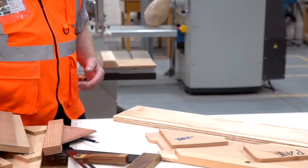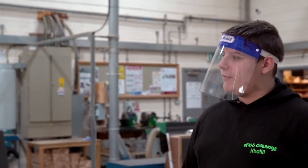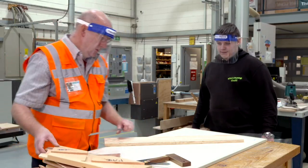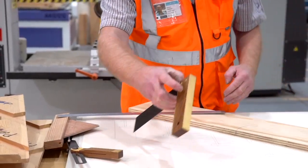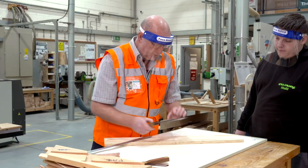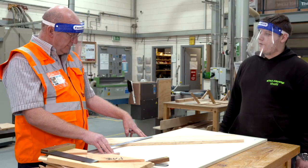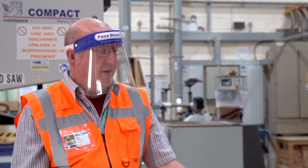So how do we decide where to set them? Can you remember what this thing's called? The margin. So the margin's 25 millimetres — that's right. So that takes us from this point to where it makes that right angle. We ignore the nosing sticking out, so they're going to touch that exactly. How do we know how often they're going to occur? 150.